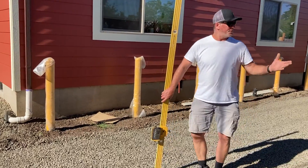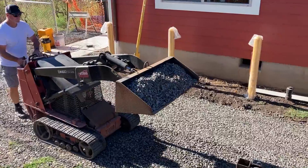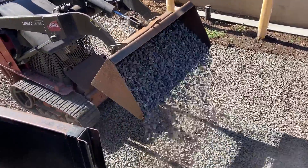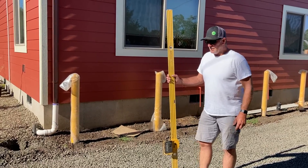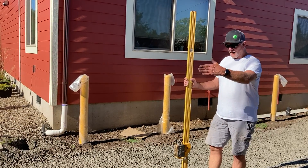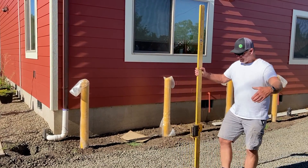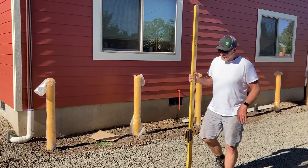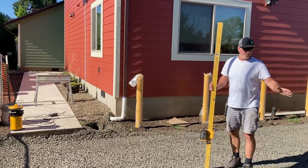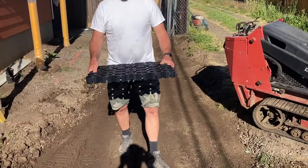We need to place just a little more gravel from the trailer, trying to get it as good as we can. It didn't have to be perfect, but we're shooting for as good as we can get. The only way to really get this better would be to put screed boards up here and rod it off like we're screeding concrete — keep a little material in front and work our way back, then it would be perfect. I made the decision last night that we'll be really close, and I'll use the machine to float this off and get it looking really nice. Then we'll compact it again.